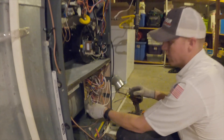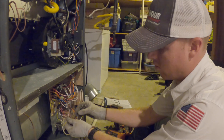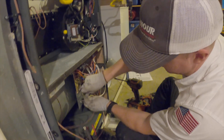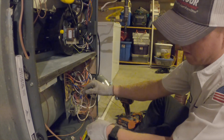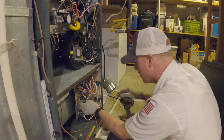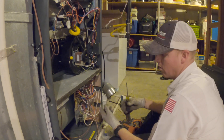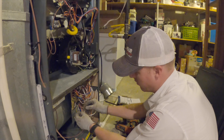This green wire coming from the thermostat is the wire that tells the fan to run. I'm going to intercept that call — these wires go up to my humidistat. So the signal for the fan will run up to my humidistat through the yellow wire, and then come back to the system through the green wire. This is how the humidistat has the ability to bring on the blower with the blower activation switch — it intercepts the call for the fan to come on and can either pass it through during a normal heating cycle, or if it senses the house is too dry, it can manufacture its own signal for the blower to activate.